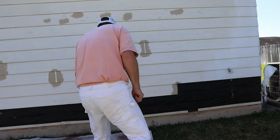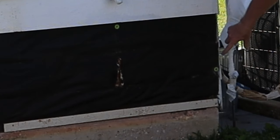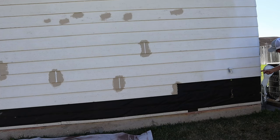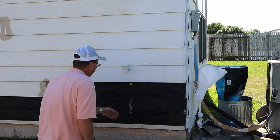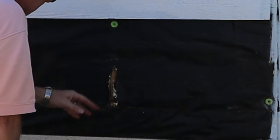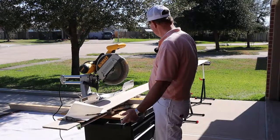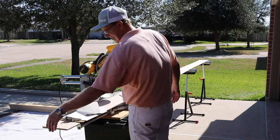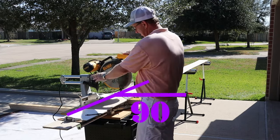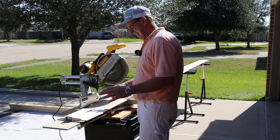The bottom board runs all the way to the end of the house, right to that red line. There's a seam on one board so I mark center at three quarters of an inch, go forward 3/32nds, and that's where the edge of my seam needs to be. I've got my miter station set up, the factory edges are square, the cross is flat, and my saw tracks at 90 degrees. I lay these out so I get the most out of every board.